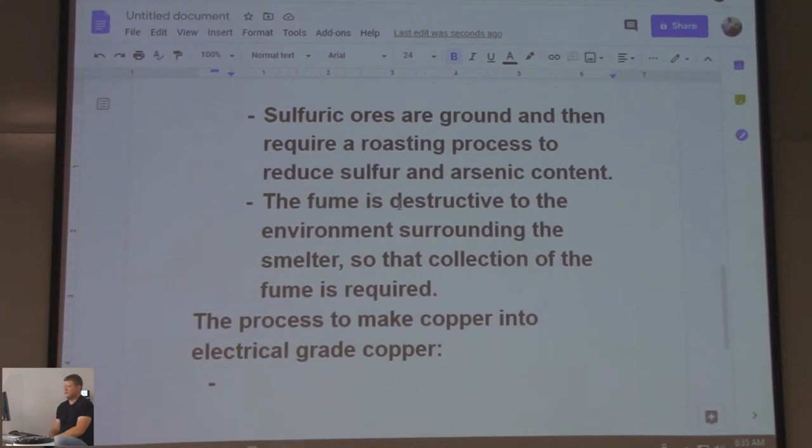They're held together with shark bites? You said shark bites? Yeah. Shark bites are garbage. I have seen them withstand pretty good pressure. They do. But yeah, no, I got a whole story about shark bites, so I'll tell you some other time. But yeah, it's got those little rings and they clamp them down. Something about that I don't like either. I don't know why. Held on by a mechanical fastener rather than solder. Solder got lead in it though, right? The old stuff did. So then you're thinking drinking water is going over lead and copper, or it's going over plastic. I don't know.